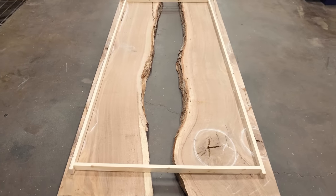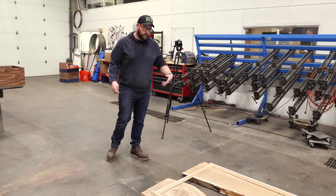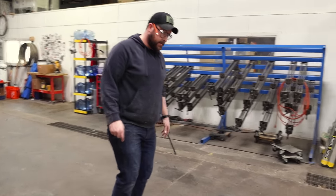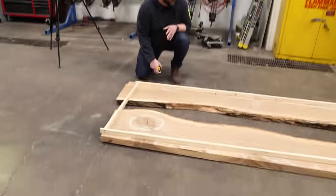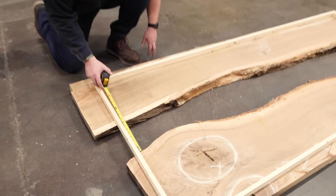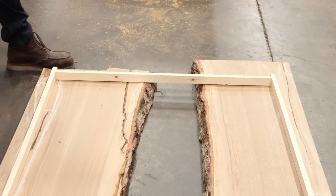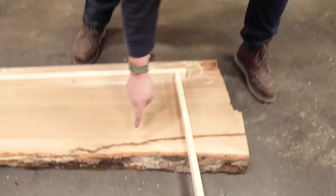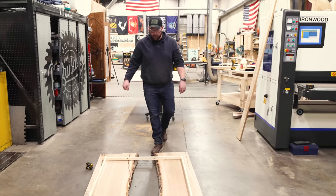The purpose of this is because I like to get as consistent a river as possible. It's also good practice on a long piece to pick the best orientation. We've got all these issues on this side specifically that we want to keep out. I want the river to be uniform and we have enough play — we're at about eight and a half there, and once that bark's off, we're at about 11. We have this huge check down here that I'll have to stabilize with resin, which will eliminate the two knots and a lot of this issue. That looks sweet — this is her, it's my girl.